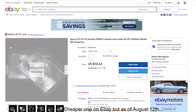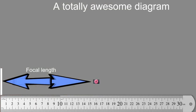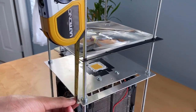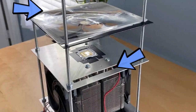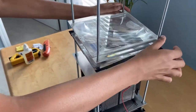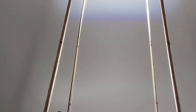Now that the light source is mounted, we can work on the fresnel lenses. We need two: the first should have a focal length of about 90mm, and the second should have a focal length greater than your projection lens — approximately 160mm. It may take a while to get these since most ship from China. Slide down the first fresnel lens with its grooves facing upward, making sure the distance from the LED equals the lens's focal length to collimate the light rays. Note the vent slot on the opposite edge for zigzag airflow. Then slide down the second fresnel lens with grooves facing downward — this is the converging lens that makes light capture more efficient.